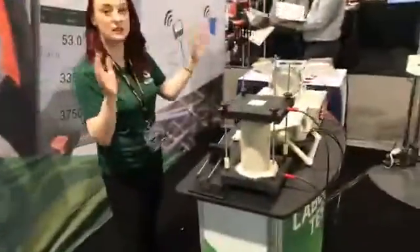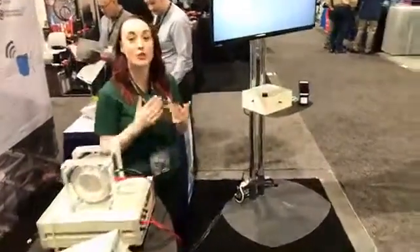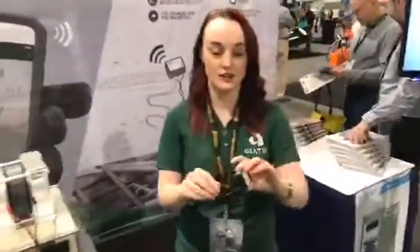We're featuring some of our NDT products and also taking a look at some of our laboratory devices. But what we're really excited to announce is that we're launching our third sensor in our line of smart concrete sensors called the BlueRock. The BlueRock is a very simple sensor — even more simple than the other sensors you may have seen. It's a bit thicker because it has a longer battery life, and it's meant to monitor the moisture and relative humidity of concrete. This is perfect for flooring applications and understanding what's going on inside your concrete to avoid bubbling and cracking later on during construction.